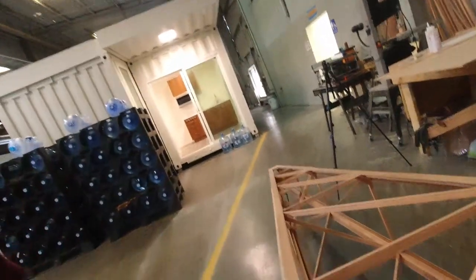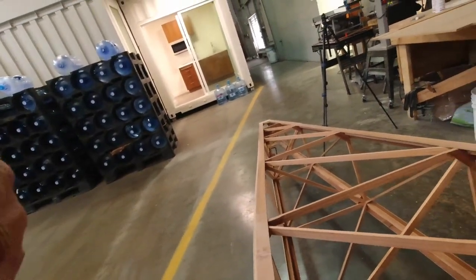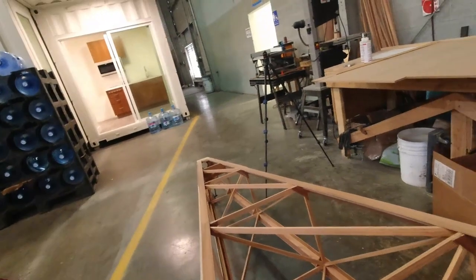So I've got those mounts. I've got this next one to do. I have my elevator trim mechanism to build, which we'll probably lay out here shortly as well. And then there's some other things that have to go in place back here where everything routes through here, where the static ports go, will require some blocks, where the elevator trim cable mounts to this side over here. We'll need some blocks on these diagonals to screw those into.